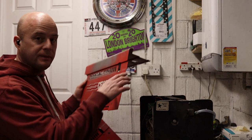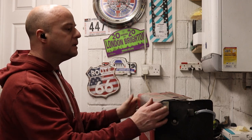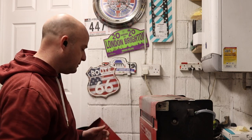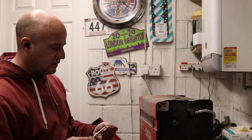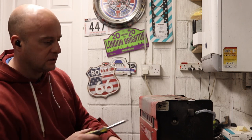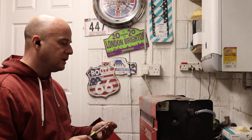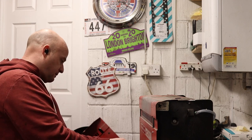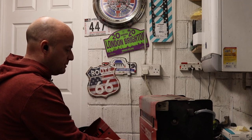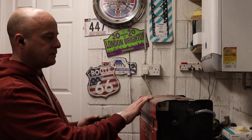It took me a little bit of time. What I did was with the device powered up, I connected the switch up first and then spent some time with the multimeter working out what goes live when you press the trigger, and that seems to do the job. So I just mounted that little gas valve on the back of the box. It could be internal or external — I put it internally because of the power going through it. I think once you see how I've wired it up, it's pretty straightforward, and swapping over to that Euro torch makes a world of difference to how the welder feels. It's a bit of a battered old welder but it still works — I would like a nice new one, something a bit better, but while it still welds stuff, what's the point?